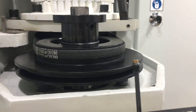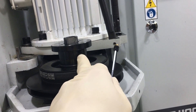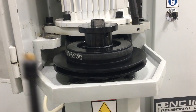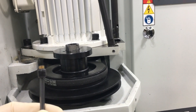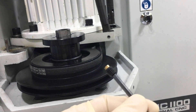Now we're going to put the set screw in — it's a brass tip because it will engage the threads that the adapter is screwed onto. Before putting loctite on it, clean the threads with brake cleaner. I'm also going to double up on the set screws — like a Bridgeport, double set screws give more rigidity and prevent backing out. A little blue loctite and send it home.